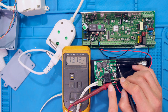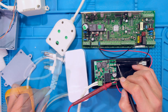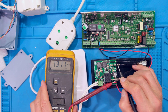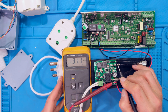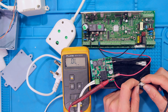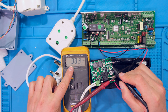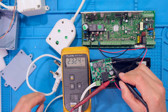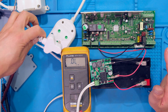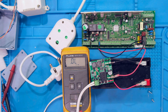Once the power supply is energized it will latch this relay closed. You can see I've got the output there — 13 volts, which is fine. Notice that the external power supply feeding this board is now off, but the voltage is still there energizing the board, because it was only after I energized the power supply that the relay latched. So if you disconnect and reconnect the battery, the voltage will drop and won't be enough to energize the board. If you're doing this installation with the power currently off, you'll have to wait until the power is on to latch the relay and get it into discharge mode. Thanks for watching.